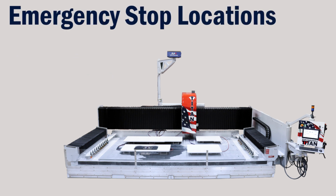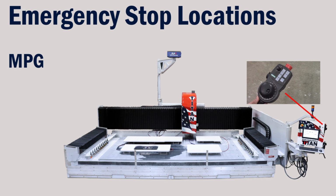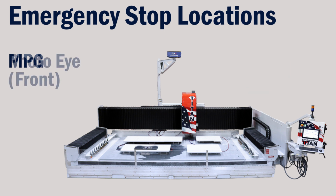Emergency stops will turn the system off and disable all functions. There are 5 emergency stops on the Titan. There is one on the controller, there is one on the MPG, the beam from the front photo eyes are also an emergency stop. There are photo eyes at the back of the machine as well. And the 5th emergency stop is the pull cord at the back of the machine.